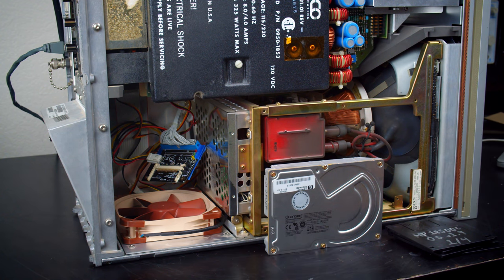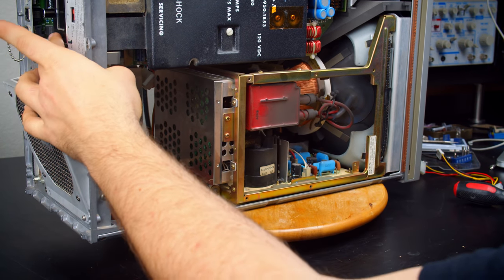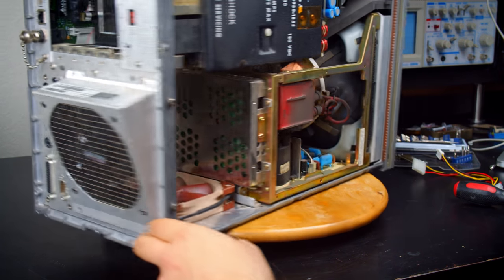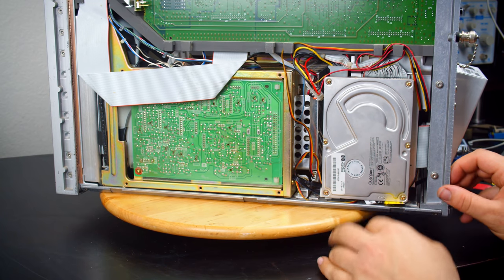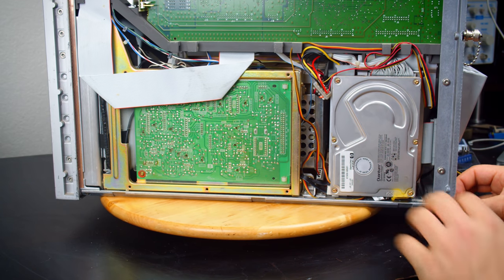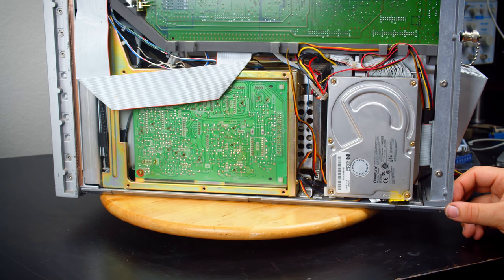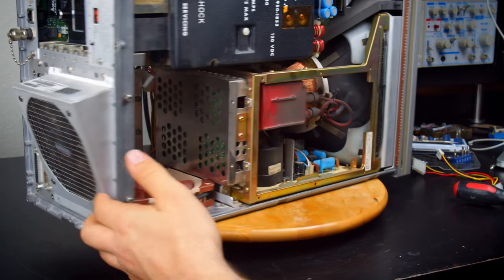So, yep. All right, and here's the final cable management if you're curious. I have the fan cables coming from the fan controller coming through the side of the card cage. The fan power cables themselves are routed right behind the hard drive mount plate, and they are managed going through here, wrapped through the actual cable management things, and then go to their respective connectors, and they're pinched in and hidden in places. That way they're not in the way. It's really no worse than whatever's going on back in here. It's just that I didn't zip tie everything together, because I know I'm more likely to modify this when I swap this over to a DOM. So, yeah, I'm very, very happy with that.